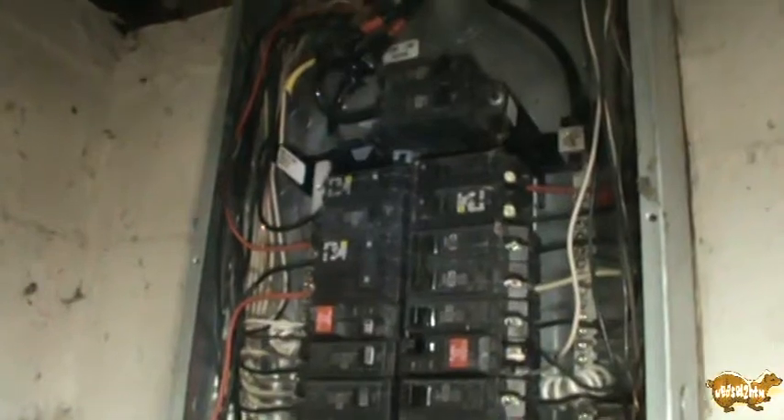I need to get the cover back on the box here. Another project I need to do that's long overdue — I need to remove this double 30 amp breaker and replace it with two 15s. What's on this breaker is among the worst wiring in the house, and it has no business being on that 30 amp breaker.